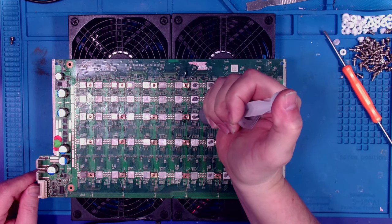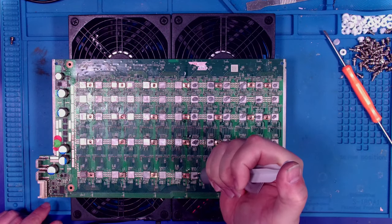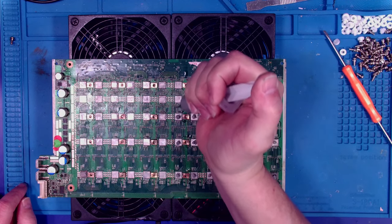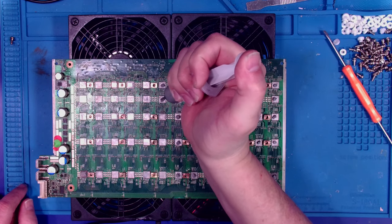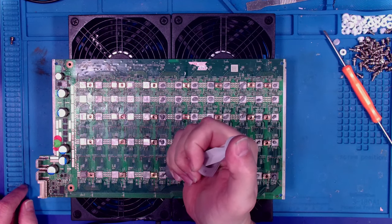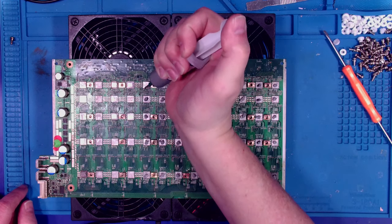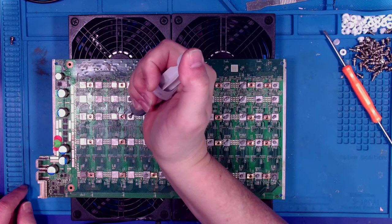Another trick is, when you're putting heatsink grease on, I remember from Dairy Queen, for those of you that have a Dairy Queen or had a Dairy Queen growing up, they used to make those soft serve cones, and there would be a little bitty curly Q at the top. Same thing when you're putting heatsink grease on. A little curly Q that you want to end on the chip and not go all over the board. Because if you do have to get back into this board, you would like to be able to do it without a complete mess. Although, 99% isopropyl alcohol does pretty good about cleaning things up, but it's still a mess.